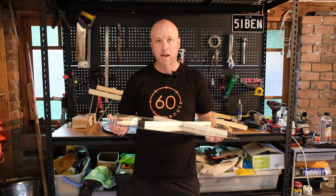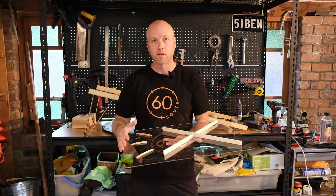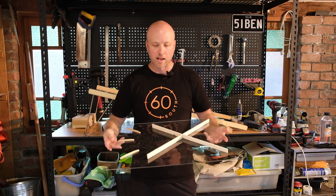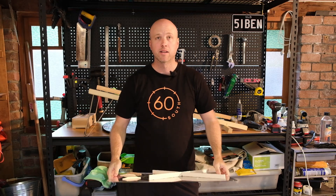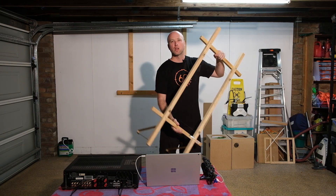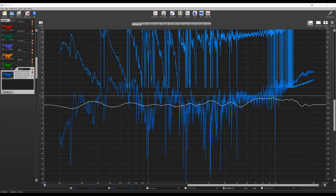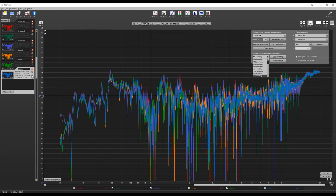On this build I wanted to go with a thinner panel because thin is light, and light means the exciter can have better control over the panel. The obvious downside is flex, but the braced panel is actually really stiff. Let's see if that makes any noticeable difference. Here's my test panel on the frame ready to go. I'm setting my usual view parameters and applying the usual 1/12th of an octave smoothing to the graph.